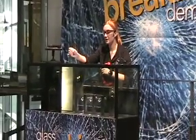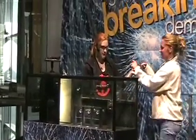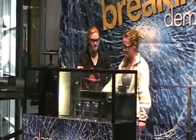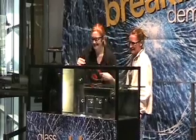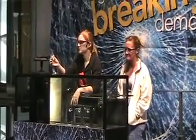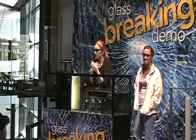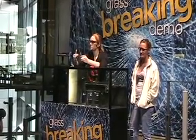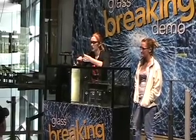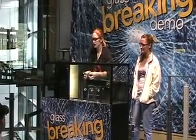Would anyone like to help break glass today? All we need to do is pull back the lever and hold it up. Regular annealed glass is pretty standard — we've seen it in our windows, dishes, and ornaments. Down here we added a lot of heat to our glass, and that formed stress and caused it to break. Here we added stress by adding pressure. Whenever pressure is applied to our glass, it bends just slightly — not enough to see, but the glass will feel it because stress is forming in there. That's why if you drop a piece of glass and it hits something hard enough, it will break.